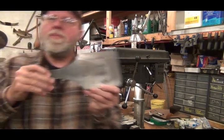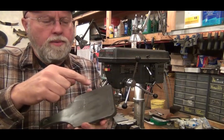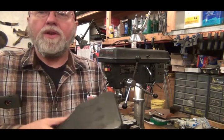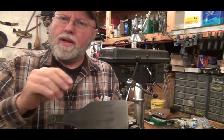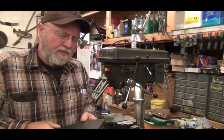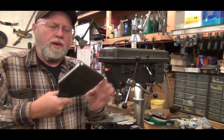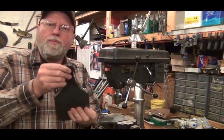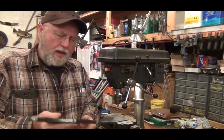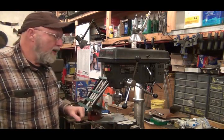So she made a plate and drilled quarter, five-sixteenths, three-eighths, seven-sixteenths, and a half-inch hole in it, so it accommodates each different size of punch she might need. I had some scrap and cut some of these out at work, put a hole in it to hang it by my anvil and forge, and I've marked one off. I have it at my drill press.